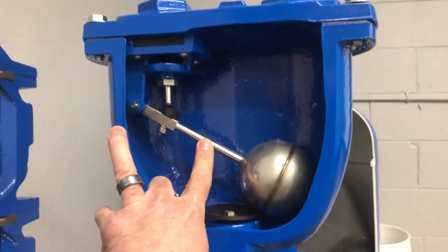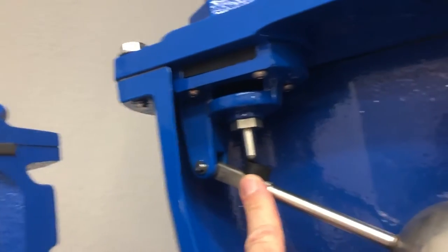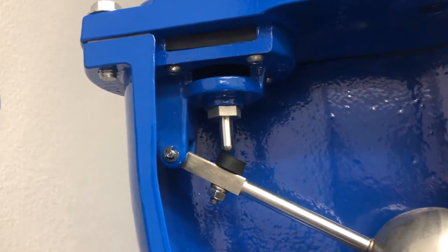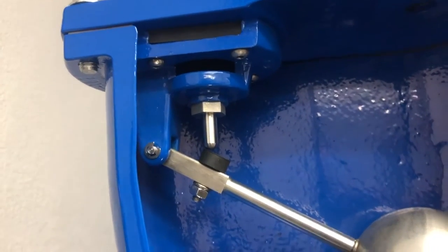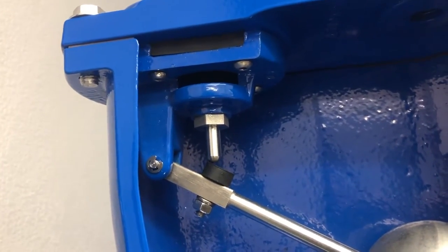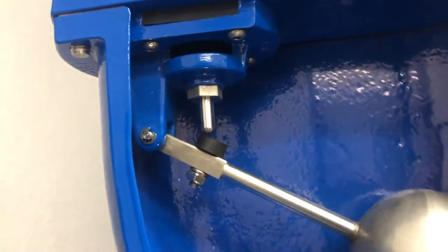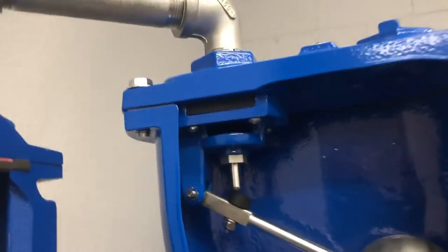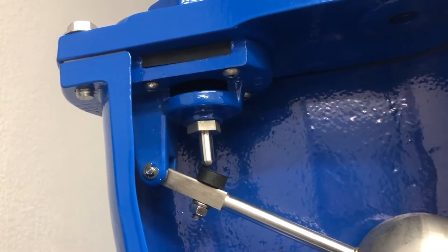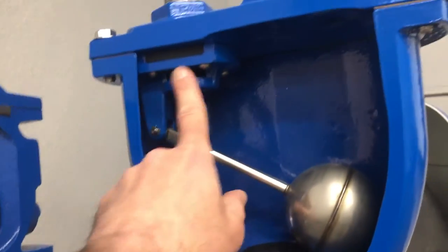The interior is always stainless steel. For the elastomer, it's important to know what pressure the valve is operating at. If it's below 30 psi, we use a soft rubber so it can seal properly. If it's above 30 psi, we go with a standard durometer rubber so it'll operate at higher pressures. One of the most common issues with air valves is using harder rubber on a low-pressure application — it might leak — so we have to make sure we use the right rubber durometer for the application.